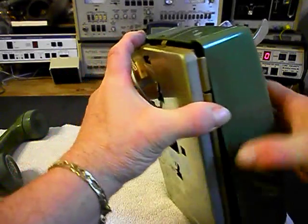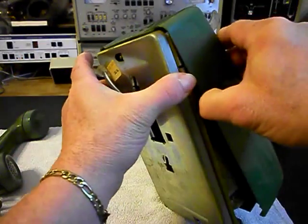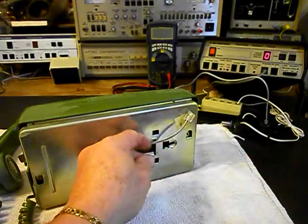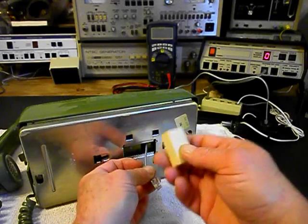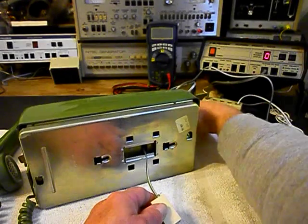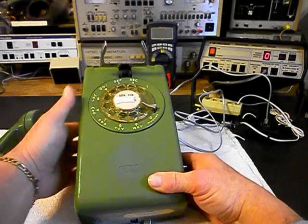There is a little clip at the top that you want to make sure you get the cover on — it's right here. There's a little metal clip inside the telephone cover and we want to make sure that that slides over that clip. Once that's slid over that clip, we can push this one down into place and it'll lock. Since we have our line cord here now that will push back into the telephone once Holly plugs her telephone — we'll look at this like it's a wall jack — she can go ahead and plug into that and then slip her phone down on the wall jack. We also want to grab our connection here so that we can connect our line up to our analyzer.